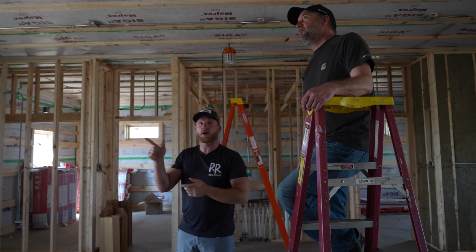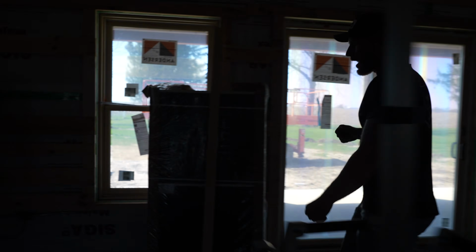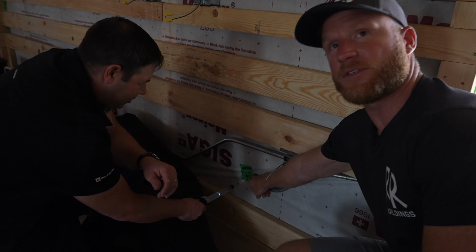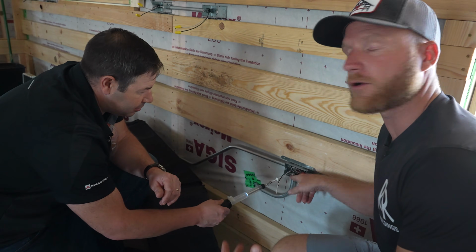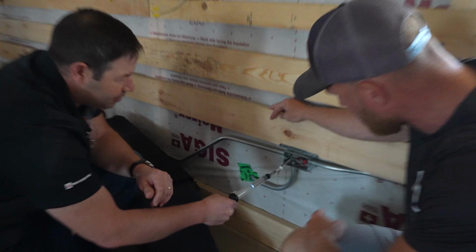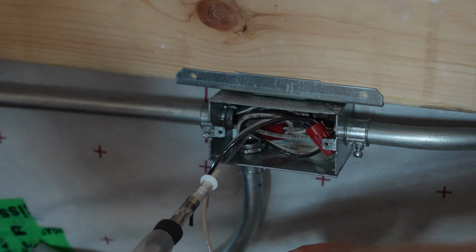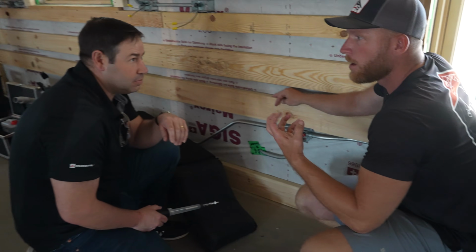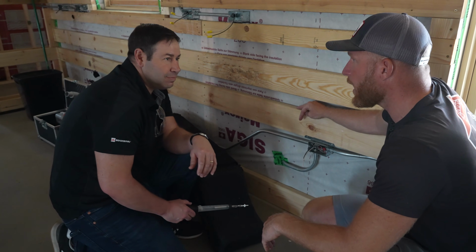Also, we've got some conduit that's going to the outside that Dan here found. And this is something that people don't necessarily think of, but we've tape sealed the conduit, but it's still going, the conduit is empty. It's hollow, so it's still open to the outside. So look at that. That conduit runs outside, so we need to do a little bit of sealing right there on that conduit with some putty or something that can be removed later. So it's good to find all these little spots.